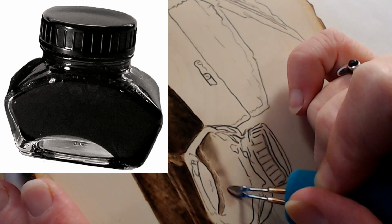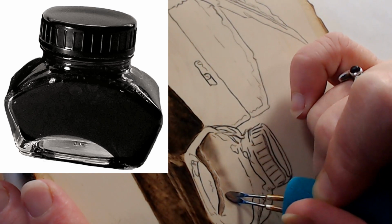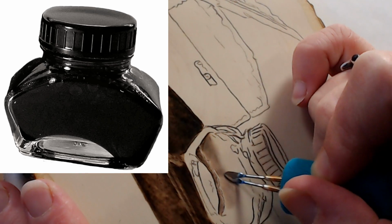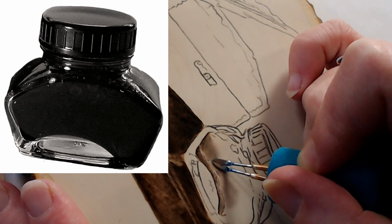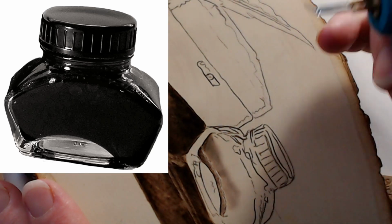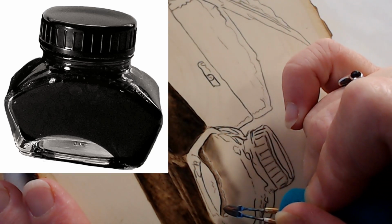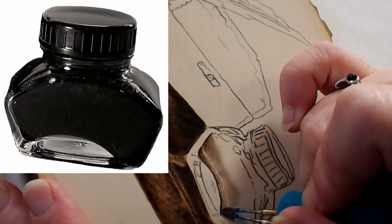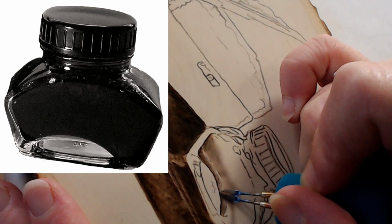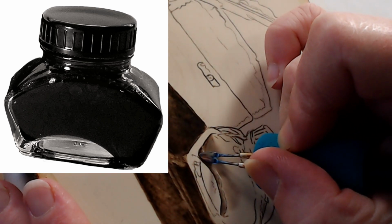Now, I'm going to do a video on this. If you notice, the burn's getting lighter. Not only is that because, of course, each part of the grain is different, but because I've made contact with this tip for a good 30 seconds, the tip cools off because the wood draws the heat. So just lift it up, kind of readjust, and that little readjustment gives your tip time to reheat.